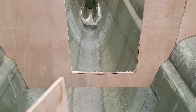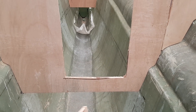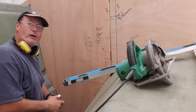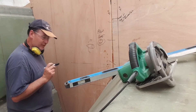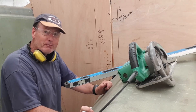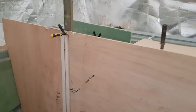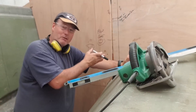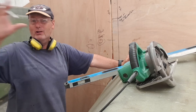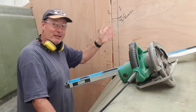This is actually open all the way to the floor here — the floor is joined to the bulkhead there and there. This bit gets cut out, but I'm going to leave it just to make it stronger for when I laminate it, so I'll laminate that bit and get a nice strong edge. I'm up in the forward port cabin — I'm going to cut a hole in this similar to that one, undersized of course. The key is that I can get into the crash bulkhead, because my thinking is I'm going to glass in the crash bulkhead and all the wing frames across the front while I've got this bulkhead in place. It's only sitting here temporarily, but it gives me a dead vertical to fillet everything onto the floor, which means all my uprights will be right. I can lift this bulkhead out, laminate it with two layers on each side, bring it in, and glass it straight in place.